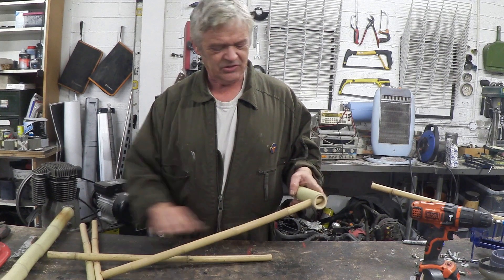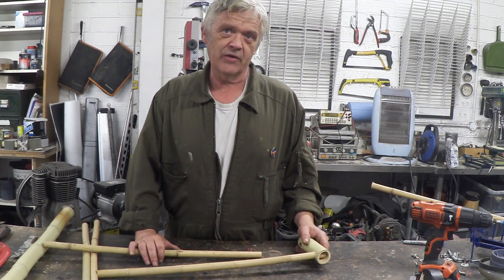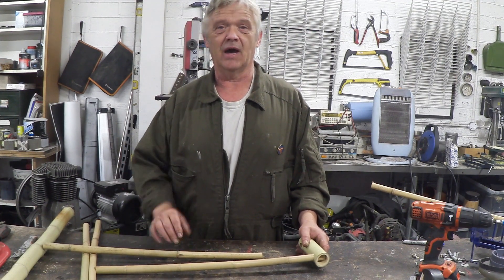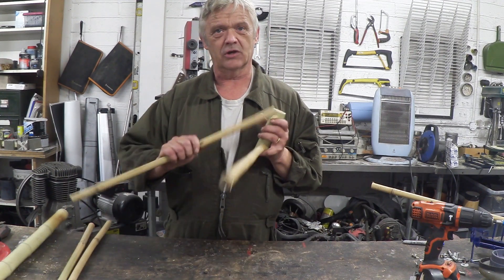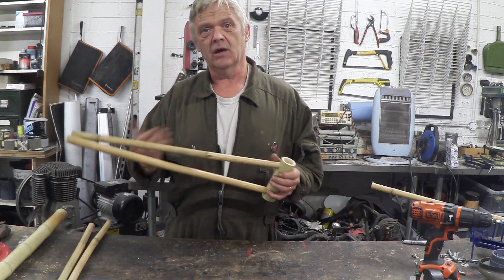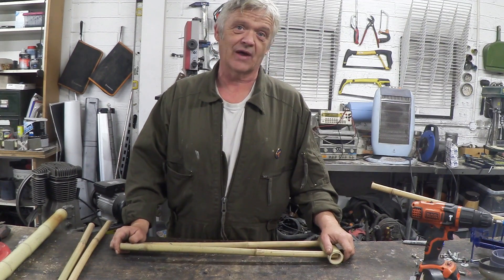I'm only using a small portion of it. We've cut out the bamboo and we're going to put it together the same way we did in episodes 115.2 and 115.6 — the e-quad and the bike frame — which is stitch and glue, really. You drill out a hole at 20mm, slot your bamboo in there, drill a little hole, stitch it around with twine, put some resin on it, and that's going to be our frame.